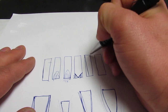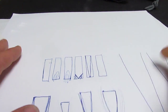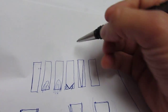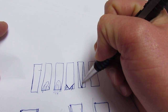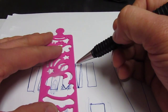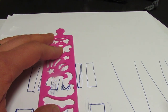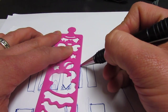Flat grind, you're getting better because the blade's getting thinner. Right? And then you have your little edge on there. Now, a lot of people who are arguing about the lean convex say, why don't you take this and just round it off? And there's your lean convex. And I would argue that's a flat grind with a convex edge. That's a combination. If you could put a straight edge up against more than 50% of this, wouldn't that be a flat grind? And maybe that's where some of this is getting lost in translation here?